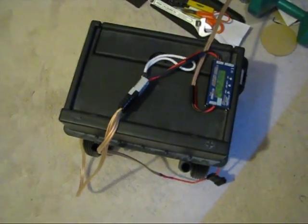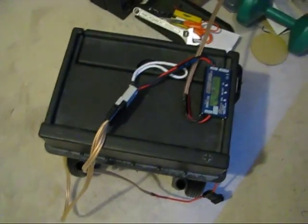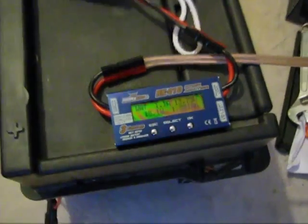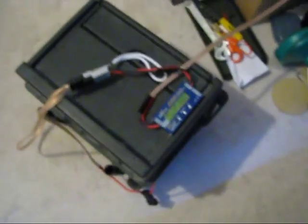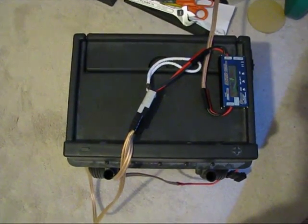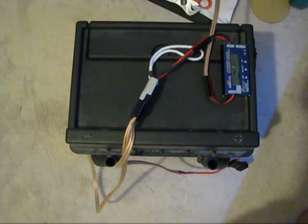Here is the finished product. The lid is securely fastened on and the batteries have been securely wedged in place inside the box. I have a wiring harness coming out the back going through a pair of power poles and some adapters to this little watt meter. I've got it charging off a 13.8 volt power supply — right now at 1.1 amps, almost done charging. On the side we've got the switches to display state of charge and control the inverter, and the outlets for the inverter itself. A quick little project. Now that this works, I just have to integrate it into the rest of my solar battery bank, which might become a video later. If you liked this video, thanks for watching — please rate, subscribe, and comment.